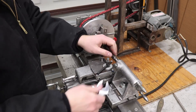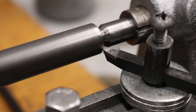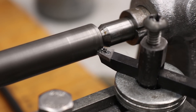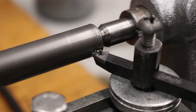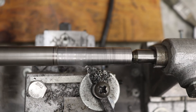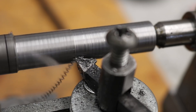The centering jig isn't perfect, so I've still got a little bit of runout, but I think it's a lot better than my previous method, which I feel like is more a problem with the rigidity of my drill press than my actual ability to locate the center on the parts. This seemed to help with turning the shaper downfeed screw.